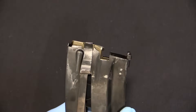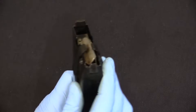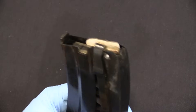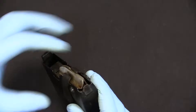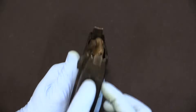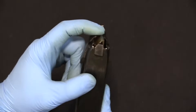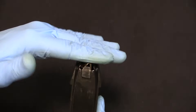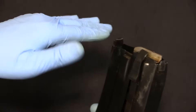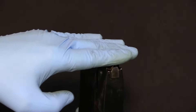Basically, what we need is to be able to have a cartridge go straight up from the magazine into the breech face. It doesn't push forward, it just goes straight up. Which means you can't have rounds coming straight up out of the magazine when the magazine's out, or else all the ammo flies out. So they have these two feed lips that hold the stack of cartridges in. When you put this into the gun and lock the magazine in, these two feed lips get spread apart and they allow the cartridges to start cycling up one at a time. When the bolt's closed, that holds the stack of cartridges in place. When the barrel opens and goes forward, it allows one cartridge to come up high enough that when the barrel cycles back, it locks over that cartridge into the chamber and is ready to fire.